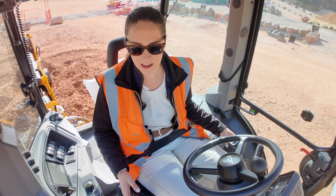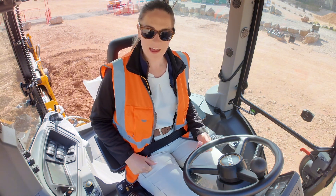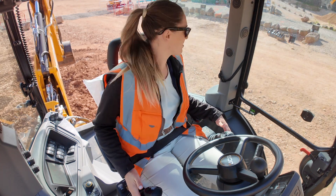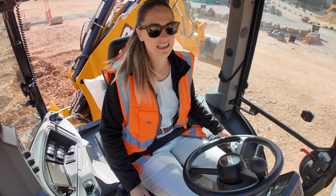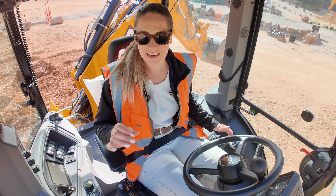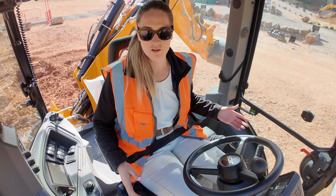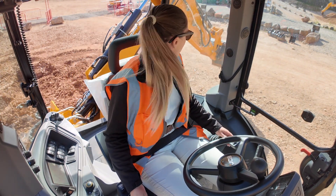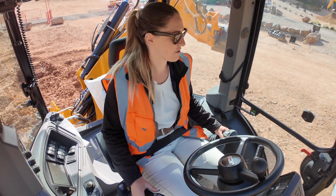Now by pressing the button on the back of my left joystick and the front of my right joystick, I can latch the excavator controls on. That means I can use the back end without having to hold my thumb down on that switch constantly, which is really fantastic if I was doing ditching. The beep you can hear is also a much softer tone — it beeps intermittently rather than consistently — so I can drive along and operate the machine whether doing ditch work or working on highways in a single carriageway. Really useful to be able to latch those controls on.